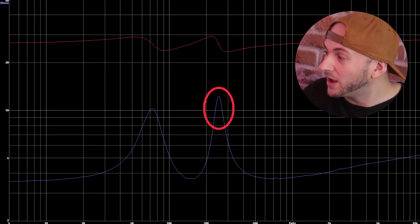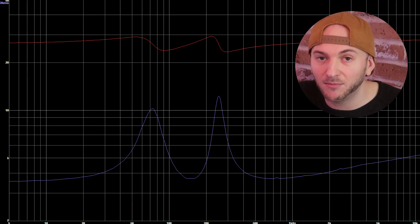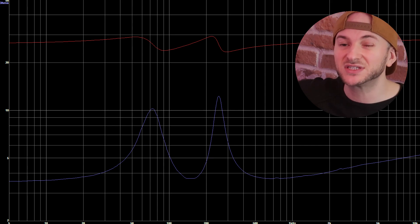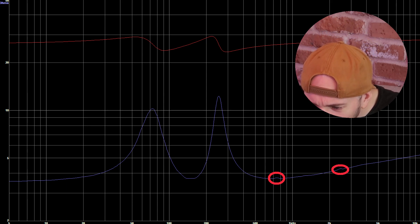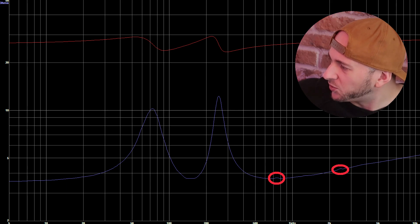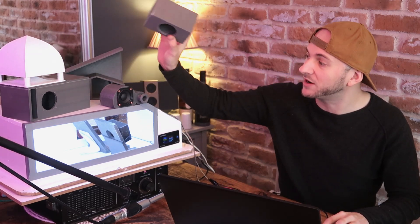And the fact that we have more air spring means we're going to have better cone control on the higher frequencies — up at around 360 hertz, which is 60 hertz when scaled. So provided the box isn't so small that we can't put enough power into it to get it going, it might perform really nicely. Now, interestingly, what I'm not seeing is any difference in the shape of this graph as a result of this kind of second chamber within the port. There's not a secondary impedance peak or anything really going on. There are a couple of tiny bumps on the way up at 758 hertz, around 1.2 kilohertz, and another one up at about 2.4 kilohertz. It's looking like a regular ported box type of response, and provided it offers good cone control on the higher frequencies being tuned so low, it should perform as well as, or better perhaps, than my benchmark aeroporting.